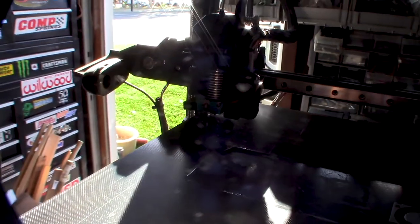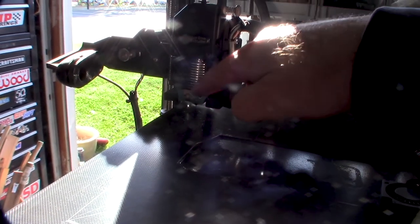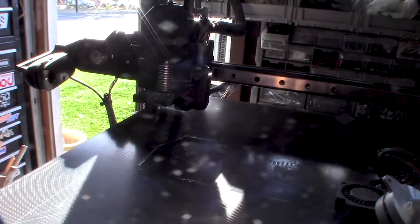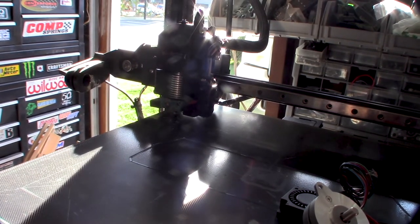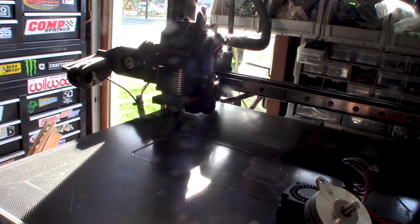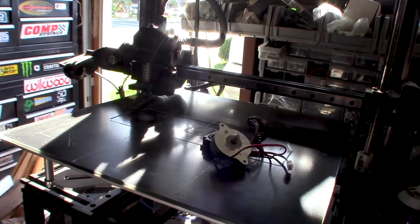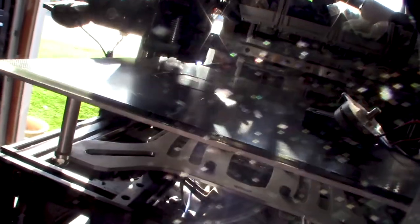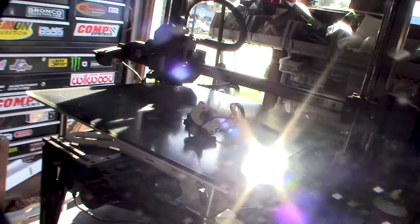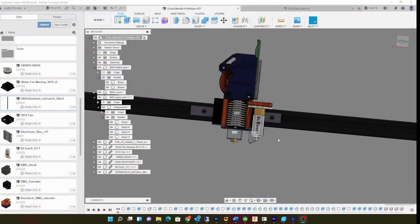Done a couple of prints — probably about 30 hours worth of printing — and no jams. I feel like I solved the heat creep issue. The hot end never got excessively hot, so it wasn't under-cooling. A lot of times it's a combination of retraction and getting the right heat distribution. It was frustrating coming out to a multi-hour print and having it jam up and stop. I'll put a link below — they make them for all different hot ends, and I definitely recommend it.